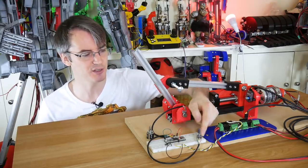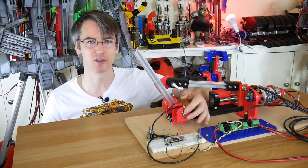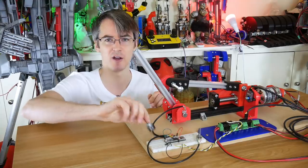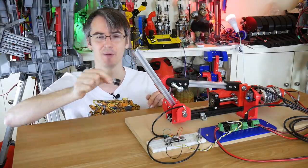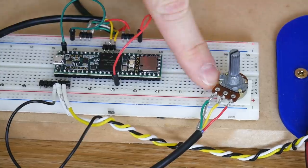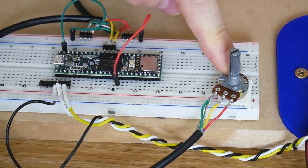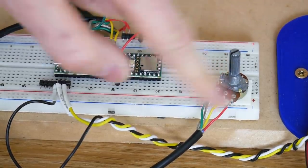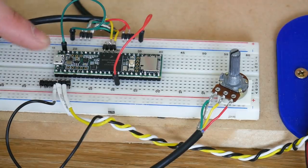Last time we used some really cheap pots to try and do feedback control. We found even reading that data was quite jittery. So first of all I'm going to try a higher quality pot, which is branded and costs 10 times as much. And then we're going to try some actual digital encoders, which are magnetic. Here's the pot I was using - it costs 99p from eBay, it's a 10K linear pot. We found the data that came out was quite jittery, even without the motor powered up so there's no interference at all. We found that data was quite jittery with the analog ins, and this Teensy has 13-bit analog ins.